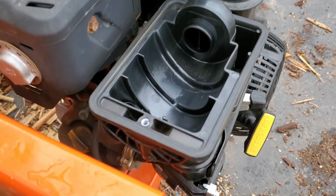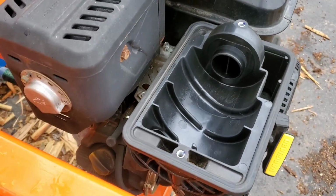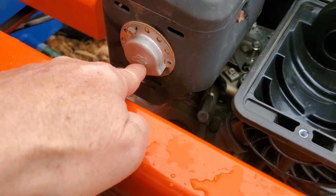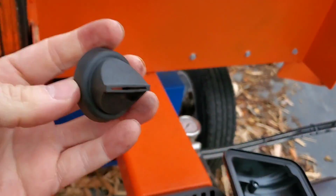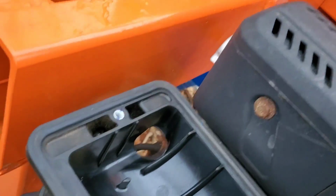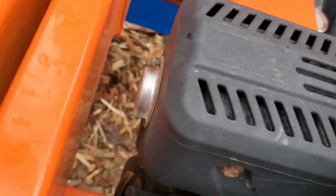So then I put the air filter back in and the lid back on, and it starts running bad again. And I just saw that this exhaust is probably causing all the problems. And this air inlet down here has like a duckbill kind of a valve to it. I know it's getting blurry here, but it has this over the hole, probably for rain water and to keep the mice from getting up inside and making nests. But that's what was going on here.